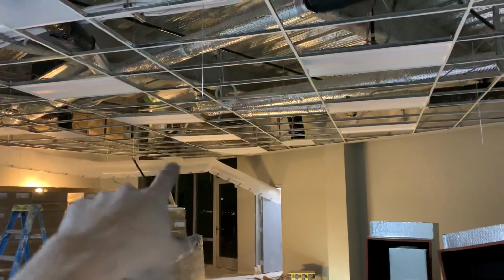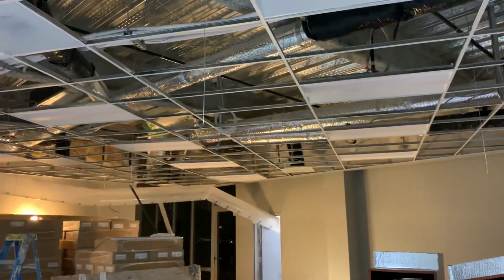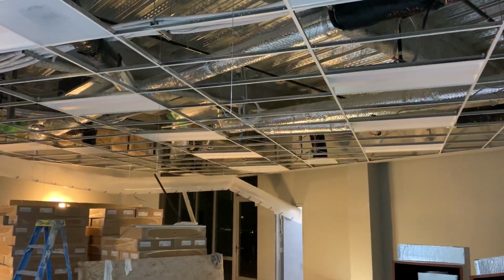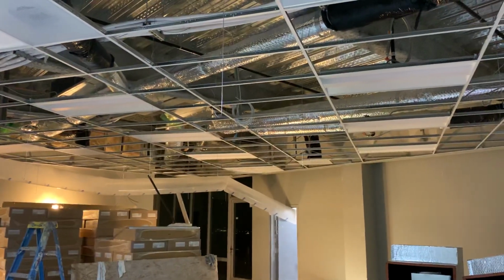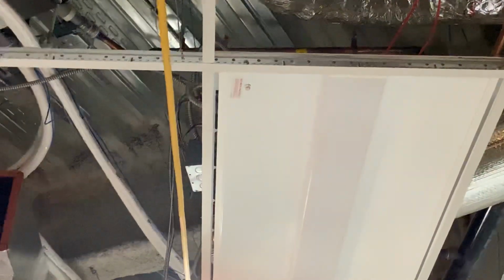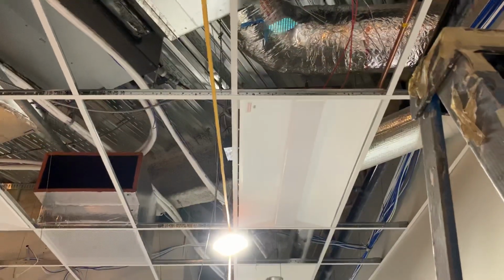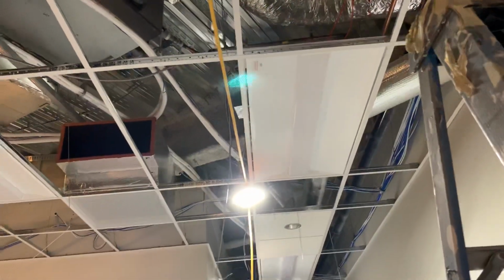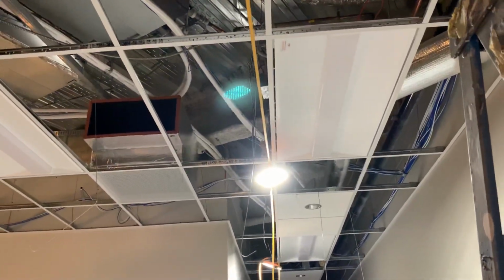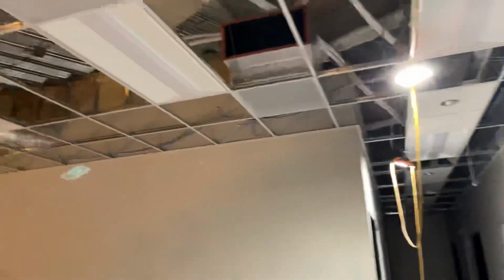And then those last couple emergency lights downstairs, I went around and connected the low charging ballast or whatever it was, the emergency battery, together, so those would be charging. Like right here, you see this little charging thing right there. So I went around downstairs and plugged those in so they turn red, so they have constant power to charge the batteries. In case the power shuts off, then the lights will work for however long, 1 to 3 hours or whatever it is. So anyways, that's what I did at the beginning of the day, and this is all I did the rest of the day.